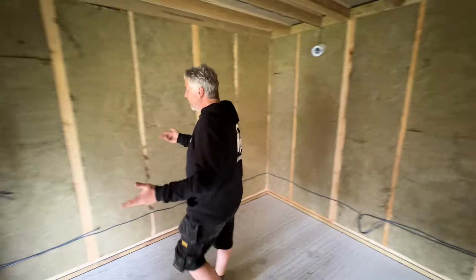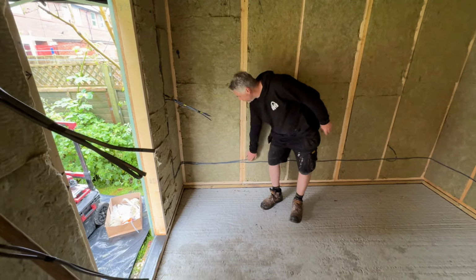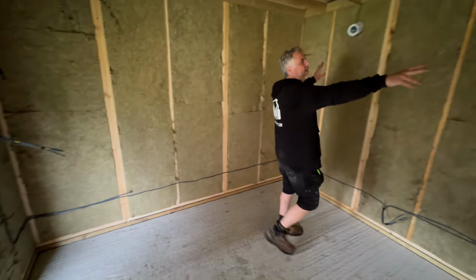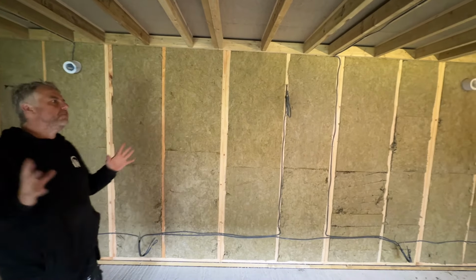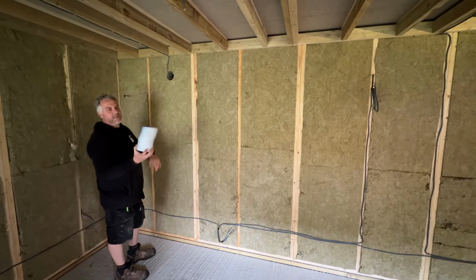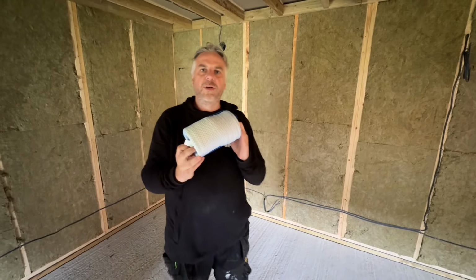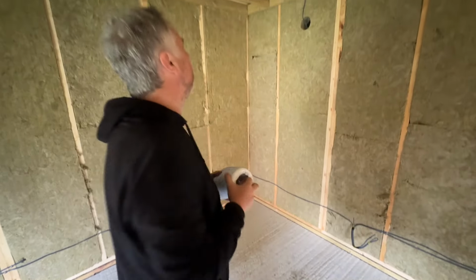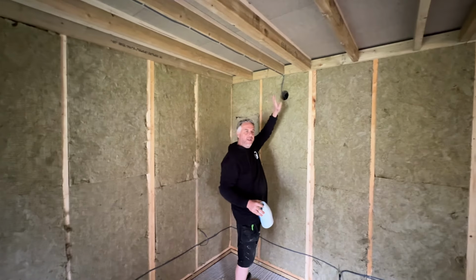We also put a feed for a rotary switch for the aircon, which comes straight from the board, straight outside, into a rotary switch. And then we've got our fan ducting. We've still got to explain how this works properly, but all I can say at the moment is we've done a couple of 4-inch holes. This is our 6-meter length of plastic ducting, which is about $7.99 from Toolstation. Yeah, 100mm flexible hose. We've also got a 1.5 feed to that, which will go to an exterior fan in a box.